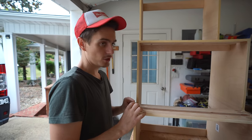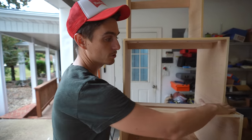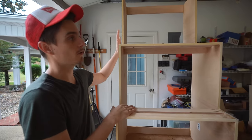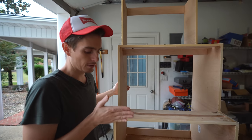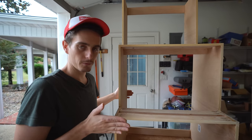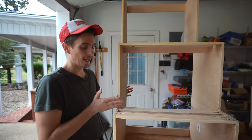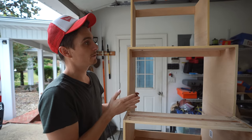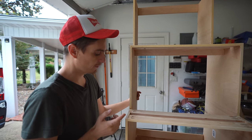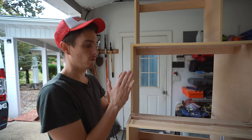The stairs are an inch thick, edge-glued pine — really sturdy when it's all done. It's also going to be fastened to the corner of the RV. We don't have much room because the passenger seat would run into it if we go too far forward, so we're stuck with plywood edges. I took some wood filler, put it on the edges to smooth them over so when we paint it all looks like one uniform coat.